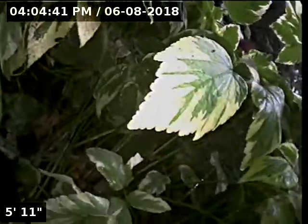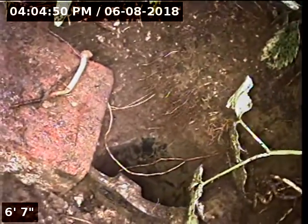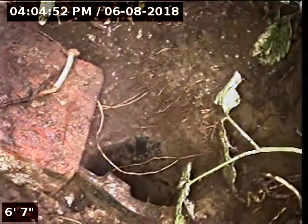We have a 4-inch ABS cleanout as our point of access, and I want to point this out first and foremost. The cleanout flange and possibly the standpipe is going to need repair. This whole spot was completely caved in. You can see the broken plastic. I had to put my camera in a sink drain or cleanout to even find this. The cap's all caved in. It needs a new flange and cap at the very least. There's the smashed cap. We had roots growing down.